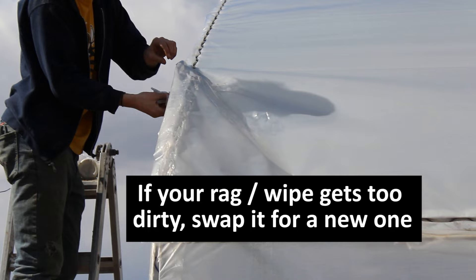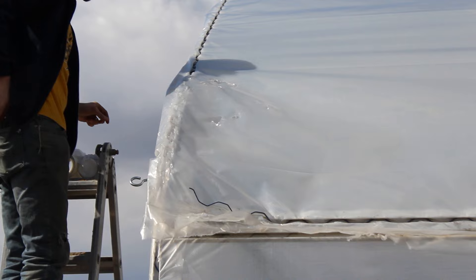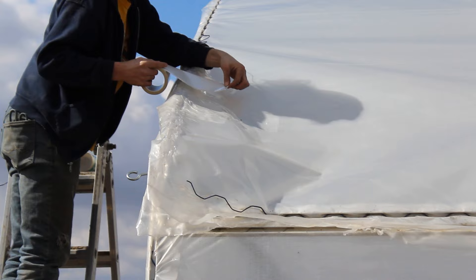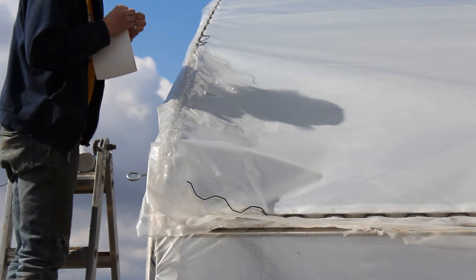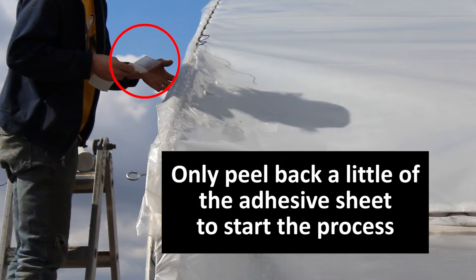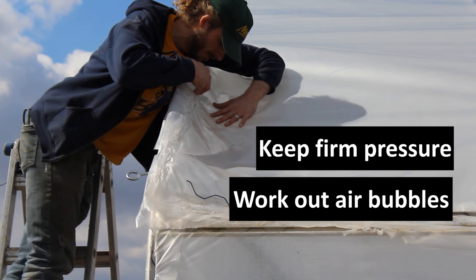Once all surfaces have been cleaned with rubbing alcohol, I let it evaporate and now it's time for the fun part — actually putting on the tape. Based on the holes I have, I'm using 6-inch wide tape, but I'll have a link in the description to all three of the different standard sizes. The first thing I'll do is hold out some of the tape to get an idea of how much I need — typically I'll want a couple of inches on either end and either side of the hole. Once I have cut the amount of tape that I need, there is a protective cover on the sticky side. I've just peeled back a little bit of it so I can start, which allows me to get a firm grip on where that's going without creating a scenario where all of the tape sticks to itself. I'm pulling back that white protective cover on the sticky side as I'm putting pressure on the plastic itself, keeping it pressed firmly against the tape so it's nice and flat and flush.